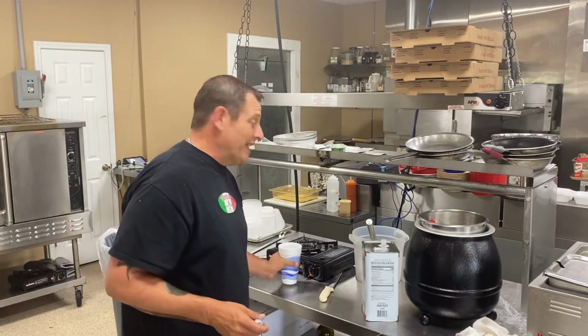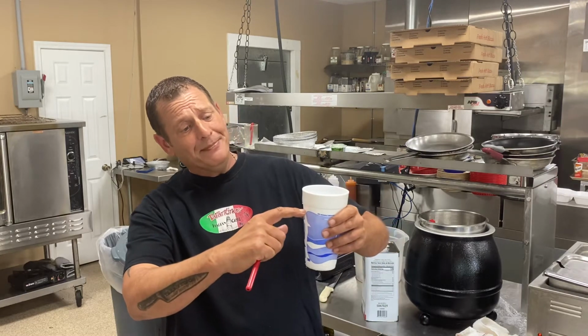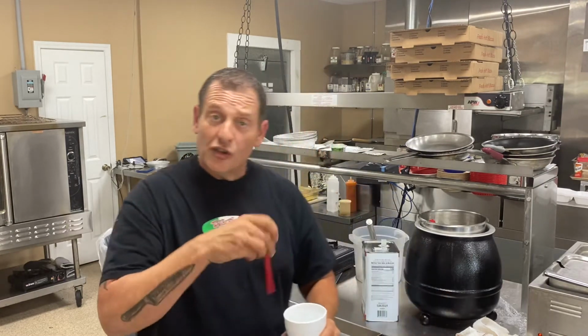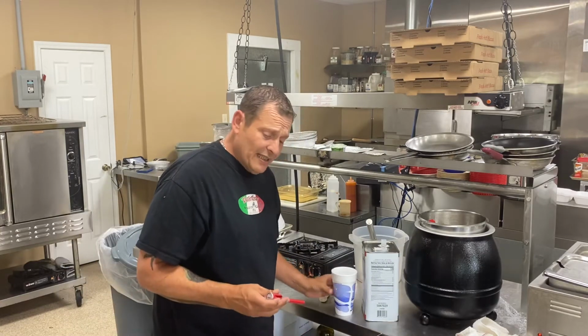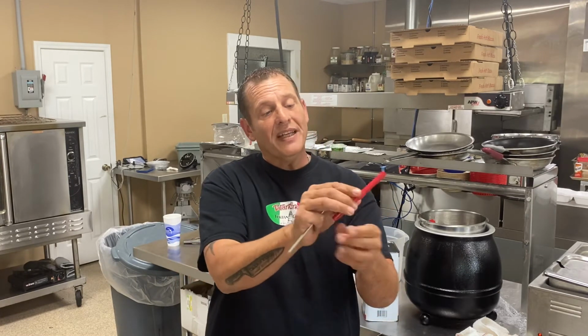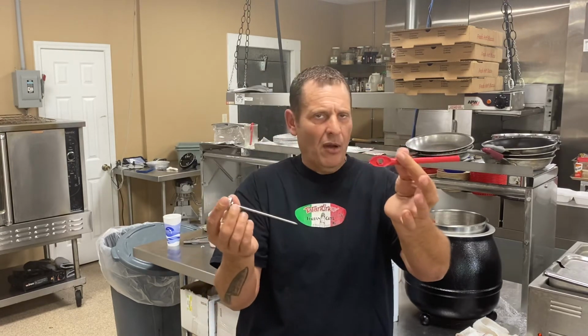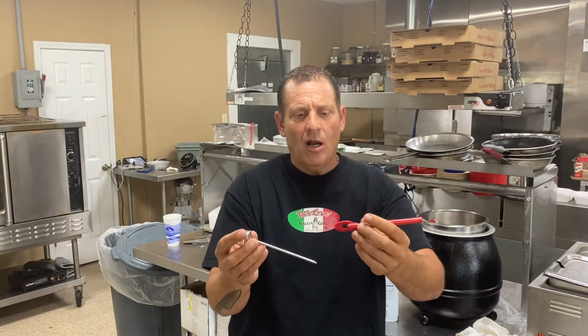All right, so what you're gonna do is you're gonna get a cup, any size cup, a deep cup preferably, and you're gonna fill it with ice, probably about up to here, okay? And once you fill it with ice, then you're gonna top it off with water. Stir it around a little bit, and then you're gonna take your thermometer out of its holster, or holder, whatever you wanna call it, and you're gonna have an attachment that's on here that slides. And what this is used for, it should be a hex. Some thermometers are different, it depends on what kind of thermometer you have.